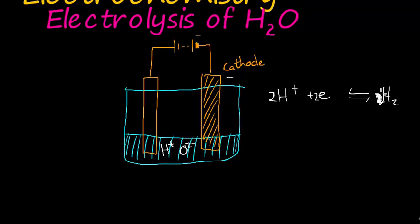That's a reversible reaction. The problem is that unless the circuit is closed, this reaction will just revert back to donating the electrons into the cathode again. So we have to ensure there is a closed circuit, so that on the one side electrons get given into the system, but on the other side electrons get taken out of the system. So this is going to be our anode, the one from which electrons flow back into our battery source.